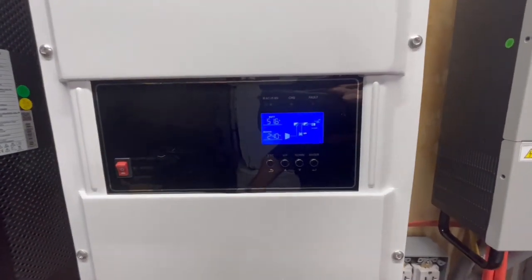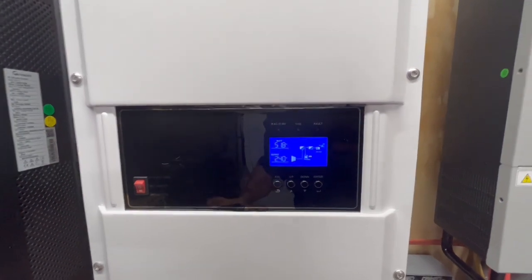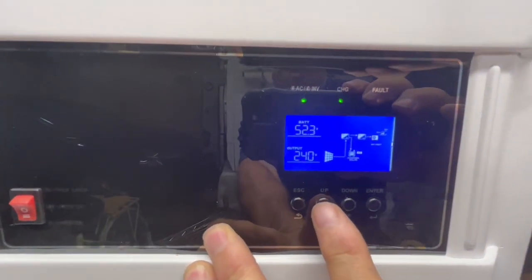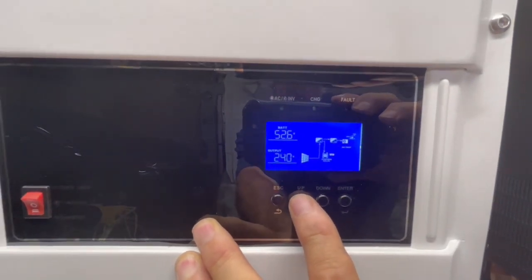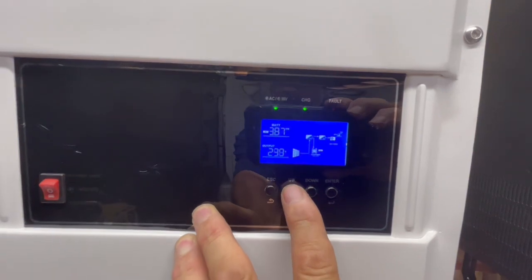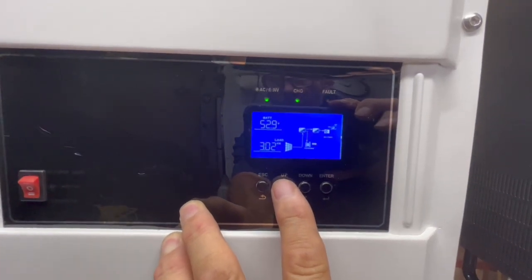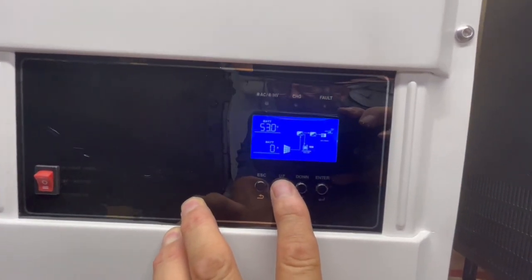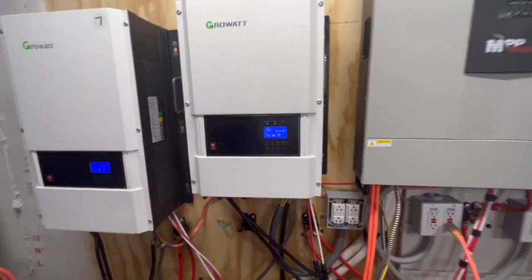Okay, that dragged it down to 51.7, 51.6, and it started it up. So 52, so we're climbing again. So it dropped it down to 51.7 or 8, and now it's back up again, and the solar panel input is bringing it back up. So we have 72 amps coming in off our solar panels, 3.87 kilowatts. And we're using 3.02. So we're 0.8 kilowatts, 800 watts more than we need. And we're up to 53. We're hanging right around 52.9, 53.